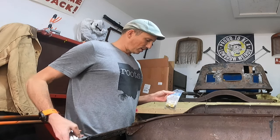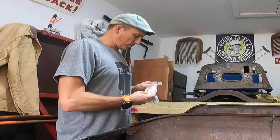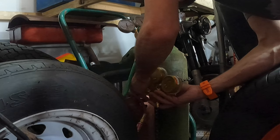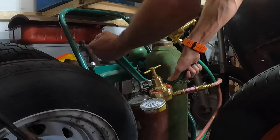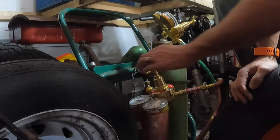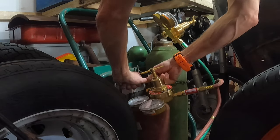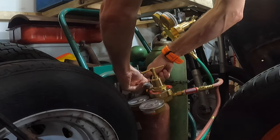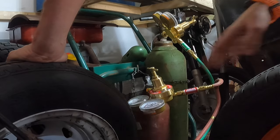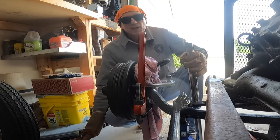Let's hope I got the right adapter — it fits the regulator side, good. Alright, I think we're in business. I had to put my regulator at a weird angle because of the length of the hoses here. Hey, we actually have some acetylene! So we have gas to the regulators, we have gas in the bottles. Now we need to pressurize the hose and check for leaks. I leak checked my lines — nothing fun to show there, I had no bubbles or anything. So we're ready to try this.